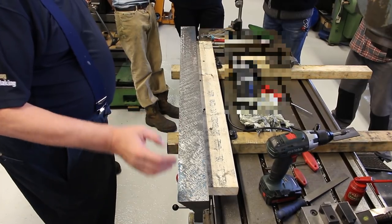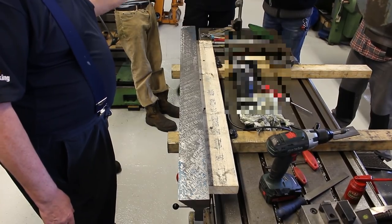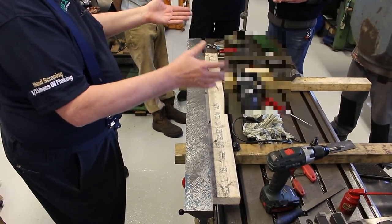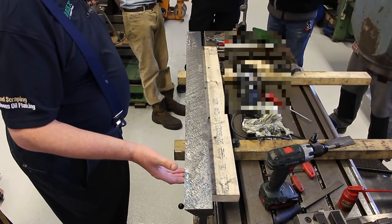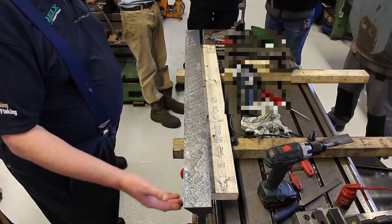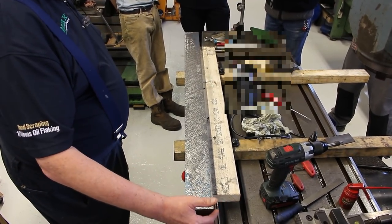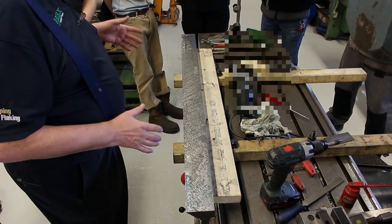Well, when you scrape a machine, you don't scrape the flat and the dovetail at the same time. You scrape both flats first, and then you do dovetails second. So you don't care if this is 50 degrees or 45 degrees or 60 degrees, but there are a couple other manufacturers that I've seen that have another one over here. So they'll make this a 45 and this a 50. It's just more convenience, because sometimes you can't get in as well.